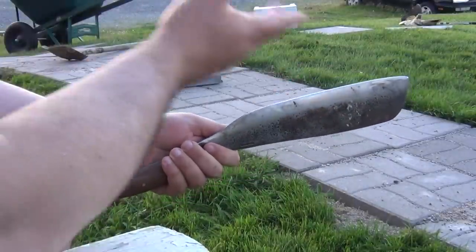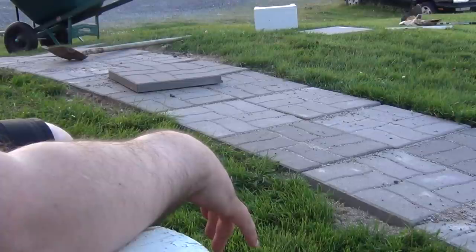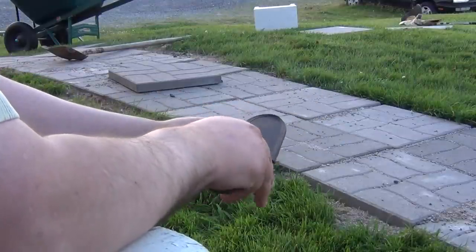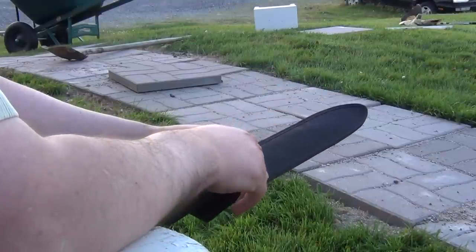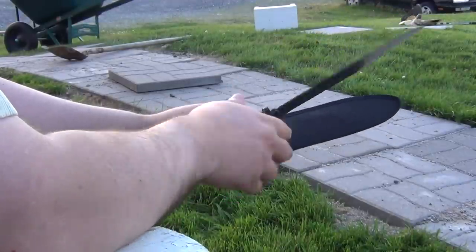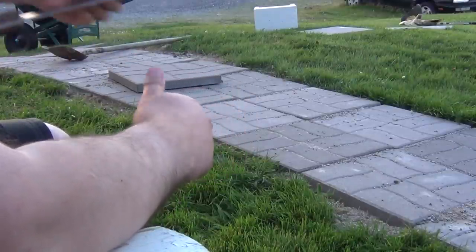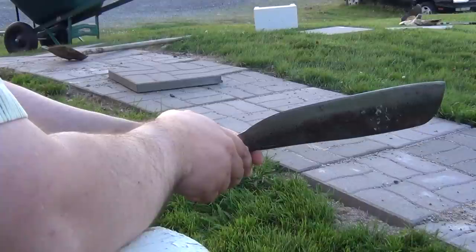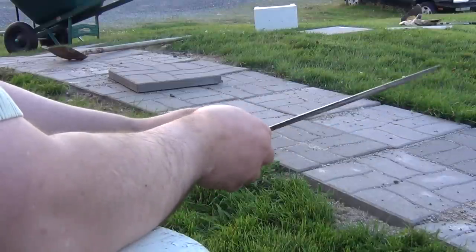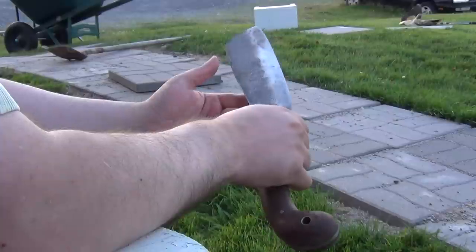In regards to carving, forget about it. It's a small percentage of a decent knife. I normally compare knives to a standard Mora, and some people might get excited about that — saying it shouldn't cut as well as a Mora. That's nonsensical. A Mora cuts as well as it does because the angle of the edge is 10 degrees per side. Any knife with an angle of 10 degrees per side or less and a primary grind will out-cut a Mora, and this one easily will on light woods. But the Condor Village Parang is floating between around 15 to 25% in terms of carving. It does a little better on lighter use when you're only putting about 10 or 20 pounds into it, but when you start to press relatively heavy, it falls far behind.